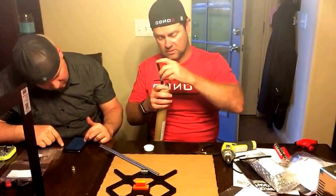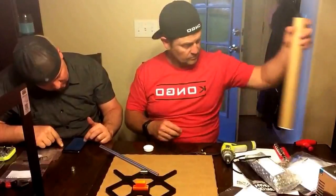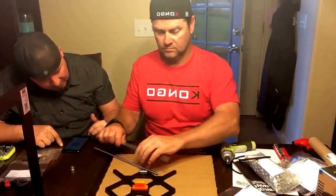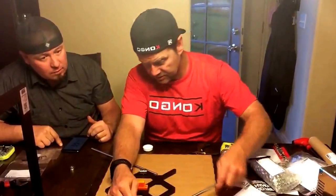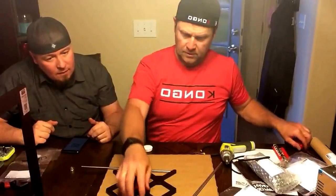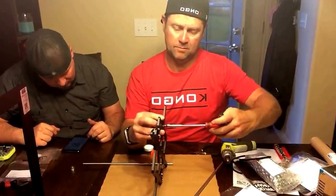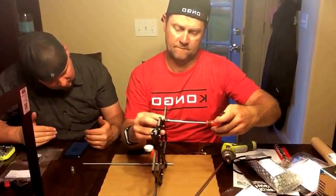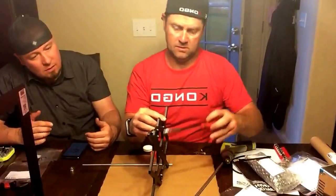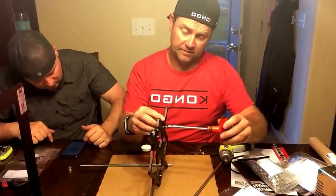Take all the smooth rods. Well, I did that. If you can't slide the rods through, it's basically talking about the alignment of your bearings. If the rods don't slide through, like this one that's slightly off? Yep, look at that. The bearing was shifted, so we will pop that out. We're also talking about if you had them angled somehow. It's the same thing, basically. I had a bearing out of alignment, so I have to fix that real quick.